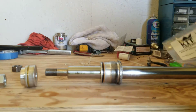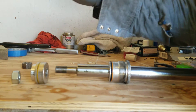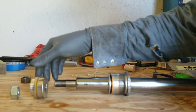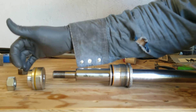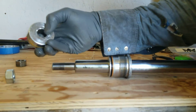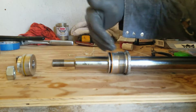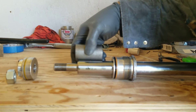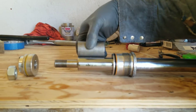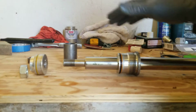Alright, so we went ahead and fished out this piece and this nut out of the cylinder. We left the cylinder connected — hydraulic cables are connected, we just undid one side. Used a piece of rebar to kind of grab this and drag it out. This nut came off allowing the piston to come loose, and you can see how it got beat up with the piston and cylinder going back and forth. The problem was this nut came loose — that's why we lost the power in the cylinder.